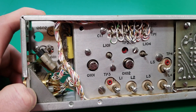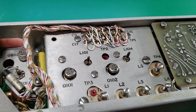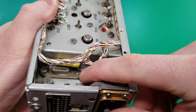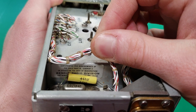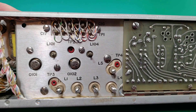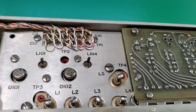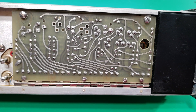Let's take a closer look at the left side. You can see the back side of the connector and some wiring — this is using Teflon wire and some cable lacing, extending up and down. Back behind here we have a power transistor and some capacitors. There's also a little sticker that says this device meets the FCC Part 15 rules. It looks like we have screws here for adjustable components on the other side, a few test points, two transistors made by Motorola, and some connections going to the other side. Over here we have a circuit board which looks like it was traced out by hand — it's on a hinge, so let's take out those screws and see what's on the other side.